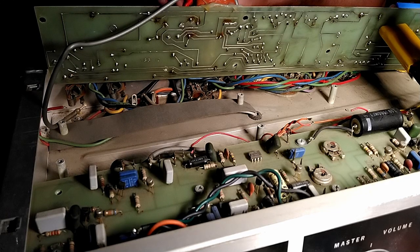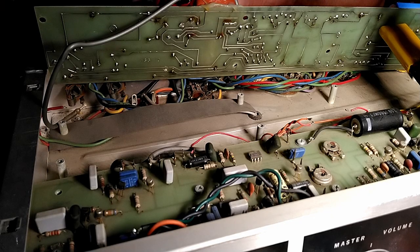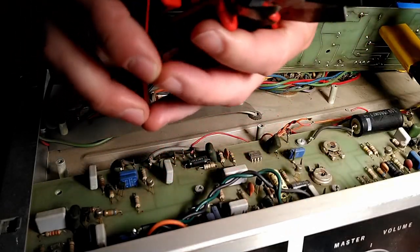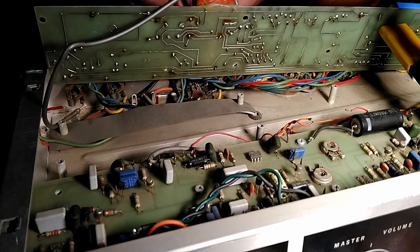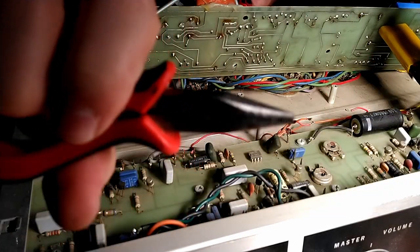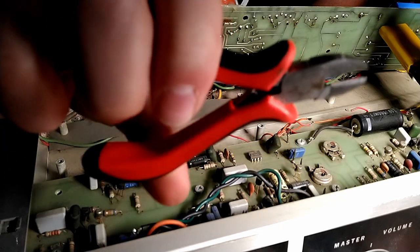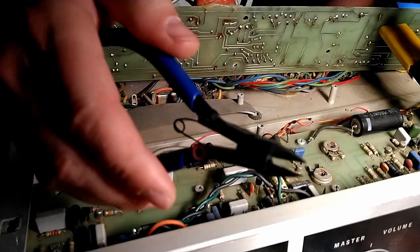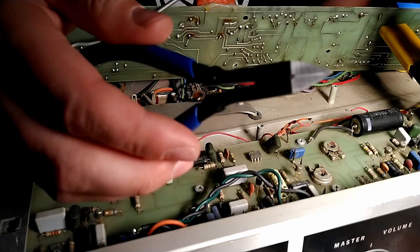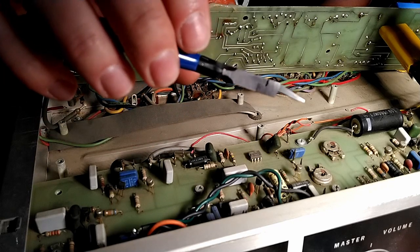Okay, now it's tool time with Tim the Tone Priest Taylor. If you go to Harbor Freight Tools, they have an inexpensive kit of pliers. It's a 5-pack, I believe, and gets you nice long nose pliers, very handy, and then our regular nose pliers. Side cutters, I only use these for cutting guitar strings. When doing electronics work, go out and spend the money on a nice set of flush side cutting pliers with hardened steel jaws. They're only like $8. You can find them online.